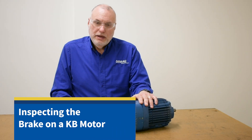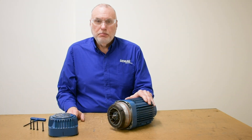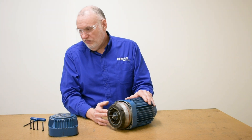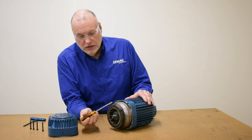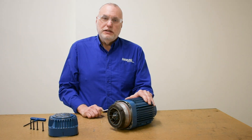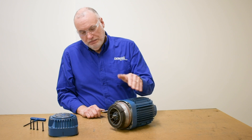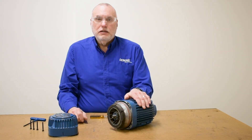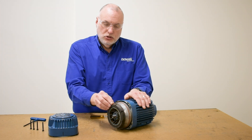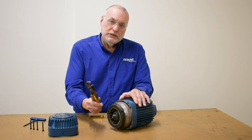So let's perform an inspection to look at this brake lining. Now that we have the cap off, you can see we have a direct visual view of the brake lining itself. We're looking for the groove in the outer lining that's used for cleaning and moving air — there must be groove left to keep using the lining. So if you're worn down to the last bit, please consider changing it. We're also looking for a dull surface and not glaze on the OD of the rubberized lining.